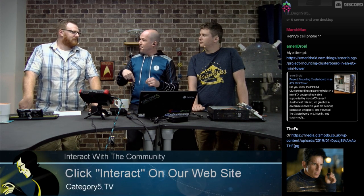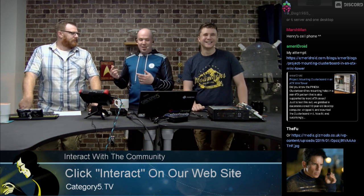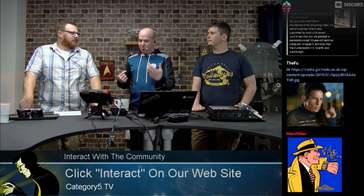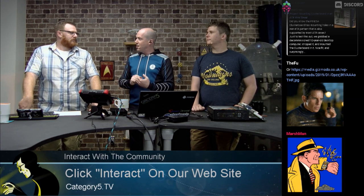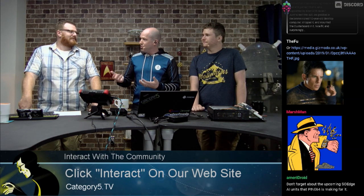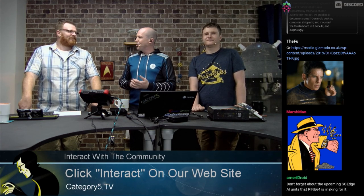Another idea I had was to write an app for your phone so that when you connect to the Wi-Fi and get to the studio, what do you normally do? You text me and say, I'm here, unlock the doors, right? Yep. So think about this. One of those Sopine modules running an Apache server with a connected app that only works on our Wi-Fi. As soon as you come into the Wi-Fi, it brings up a thing that allows you to push a button that turns on a light that tells me that you're here, basically like a silent doorbell. It's a smart office. That's awesome. That would be an easy one, just a relay coming off of the GPIO, being triggered by a GPIO command on the Apache server and a little app that lets you ring the virtual doorbell, but only when you're connected to our Wi-Fi, so just when you get to the studio.